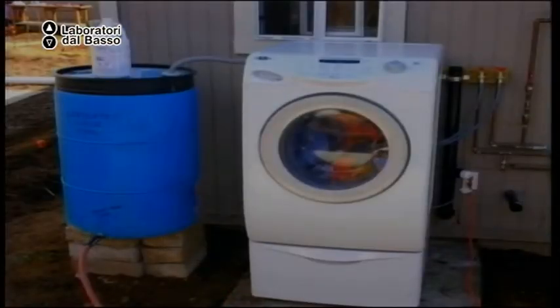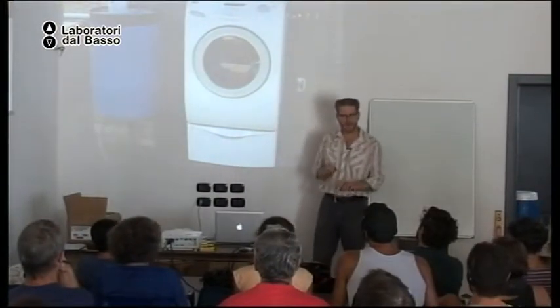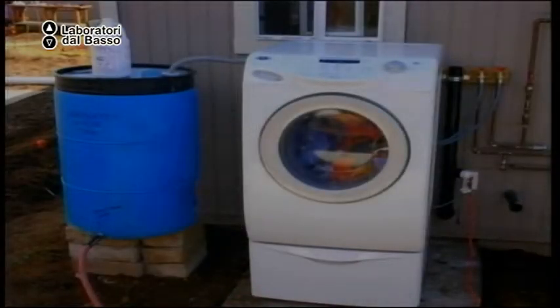If you have a washing machine, next to the washing machine is a pipe for the sewer. But you can take the drain hose from the washing machine and put it into a tank that immediately starts to drain the water through a hose. The only reason for this tank is that the garden hose is a smaller diameter than the drain hose. If you connected this to that, water would back up in the hose and you would burn out the pump in your washing machine, because there's too much surface friction on too small a diameter hose.